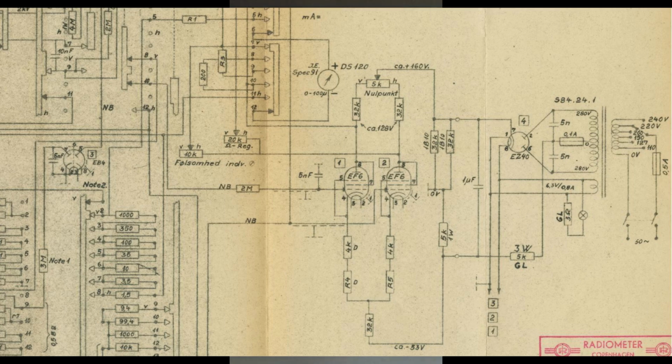And we see the 0 point, the 5K potentiometer that is in the front. This is of course our 0. And then we have another potentiometer to the left. It's a 10K potentiometer. This is the sensitivity, and this is actually amplification. So what I think you need to do is adjust the sensitivity or the amplification in voltage mode, in that mode where you need or want the highest accuracy. And of course you expect it to be pretty good in all the other ranges.